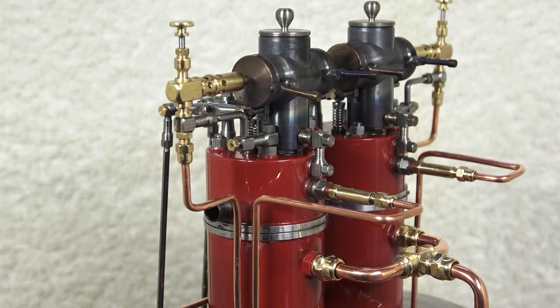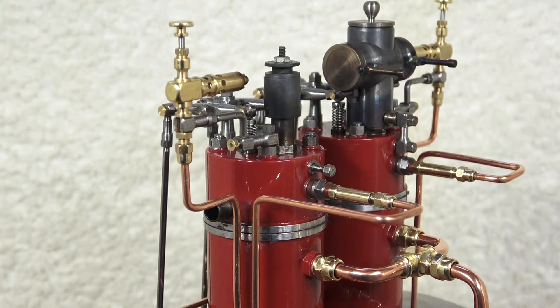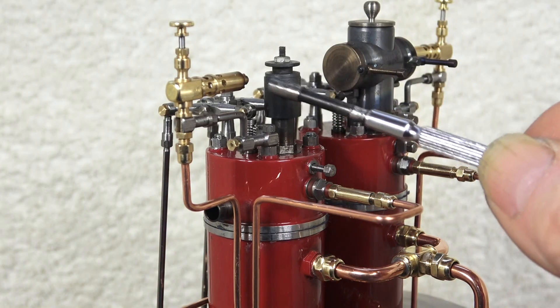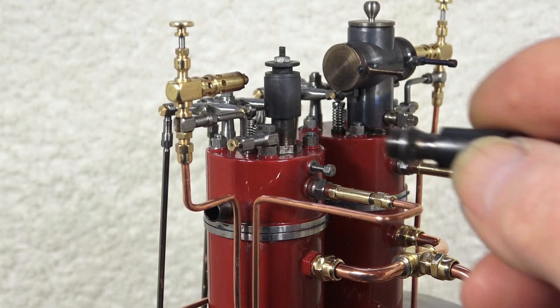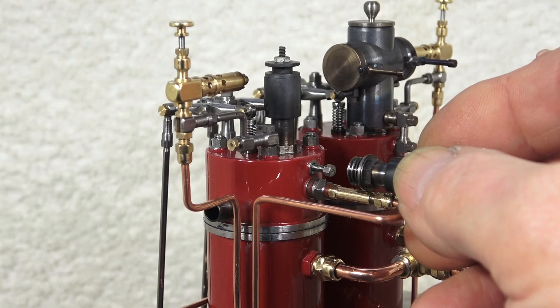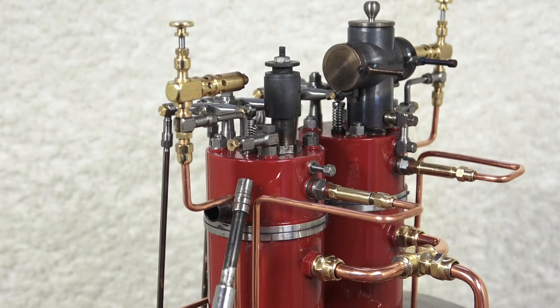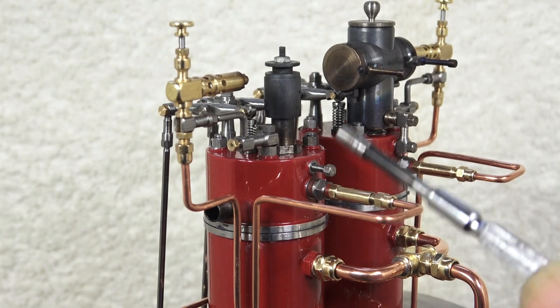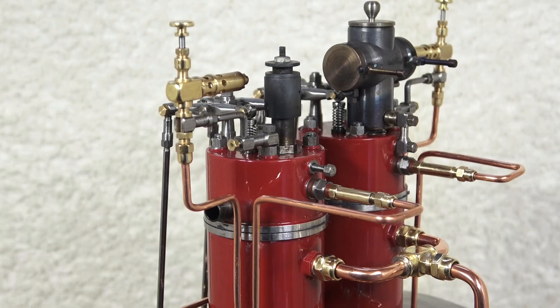Another main difference is that this engine has the hot bulb situated and mounted at the top of the cylinder head, and the injector at the side of the cylinder head. While the old one had the hot bulb situated about where the injector is now, and the injector where the hot bulb is now. That means the old system had a kind of square combustion chamber, while the new one has a combustion chamber in line with the hot bulb, and it gives a much better combustion.